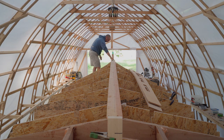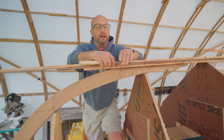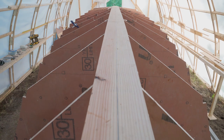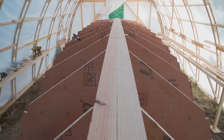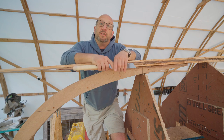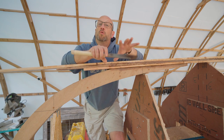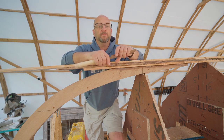Well, just by sighting down the pencil line, it looks like the keel lamination wound up reasonably straight. There was always some possibility that there'd be some slight variation as you move fore to aft, because I did cut the notches in the station molds just slightly wider than the stock to make sure that I wasn't going to be struggling to get anything put into place.